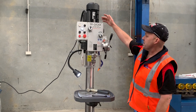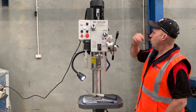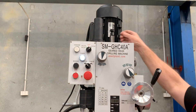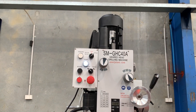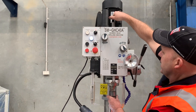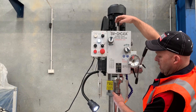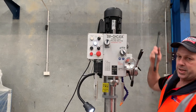Basically in this particular one there's a 16mm drawbar that goes straight through the head in the back of the spindle. What you basically do is you loosen this up — there's a little locking nut there. Loosen that off, then just get your soft hammer. That guard fits over and covers it when it spins around. Just tap that up there and as you can see that draws it down and loosens it off. Take that out now and that'll come down. And that's the 16mm drawbar.